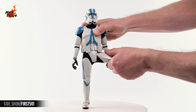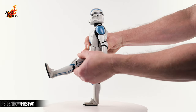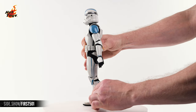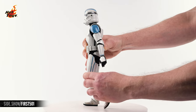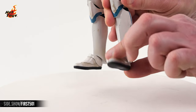The legs will lift laterally nearly 90 degrees. They'll also kick out nearly 90 degrees to the front, and a few degrees to the rear. The double-jointed knees will bend more than 135 degrees, and a pivot joint at the thigh will allow the legs to rotate there. The feet will rotate at the ankles and also extend a bit in every direction.